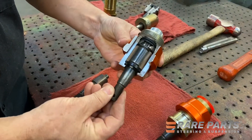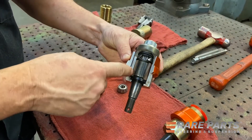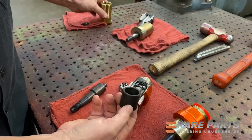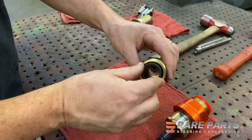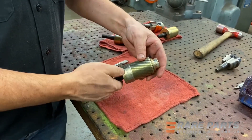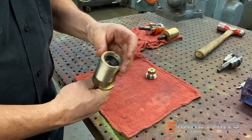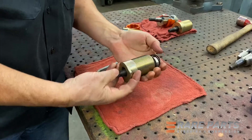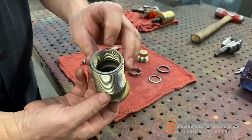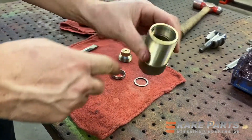Some of the challenges that we think you'll run into is the fact that we press this PTFE epoxy bearing into the housing — that's this piece right here. This is one of the upper ball joints that's been cycle tested, kind of used and abused around here. So we're going to disassemble this, take the threaded plug out, push on that stud, and now we're going to press out the wiper seal and that PTFE epoxy bearing. Let's see how we do.